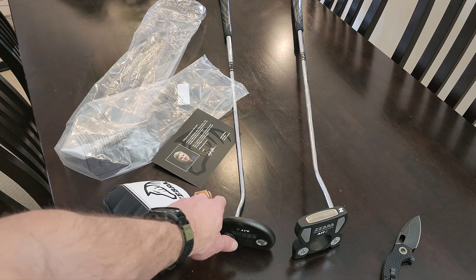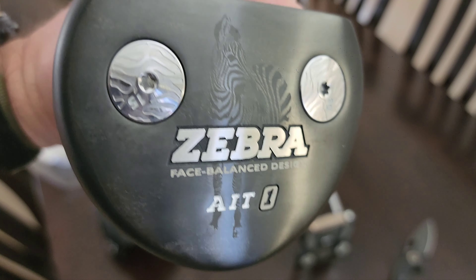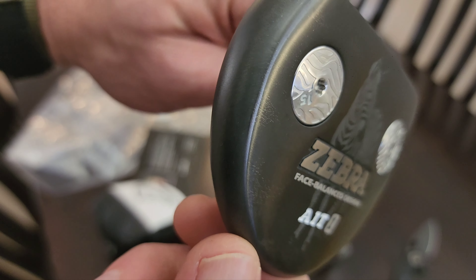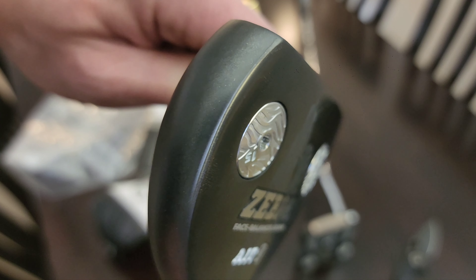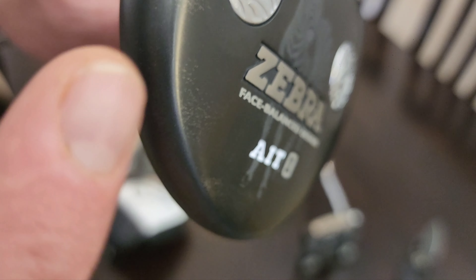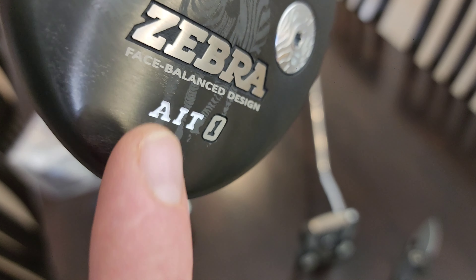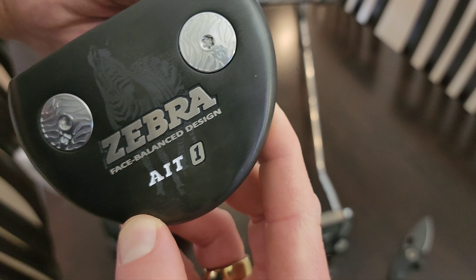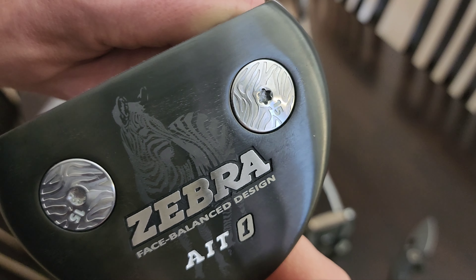Petey checking in again guys. I've just had a bit more of a look at this AIT-1 - you can actually see the finish on this one here, it's got like a pitting to it which doesn't lift. As far as quality control goes that's not great, because you've got this transition in the finish from here to this edge where it's smooth. You can really just notice here and here it's like pitted - it's almost like an etch bleed from the actual zebra, so that's definitely not machining oil or anything like that. You can see it just around all different spots, especially there where it's got like a carryover bleed from that zebra.